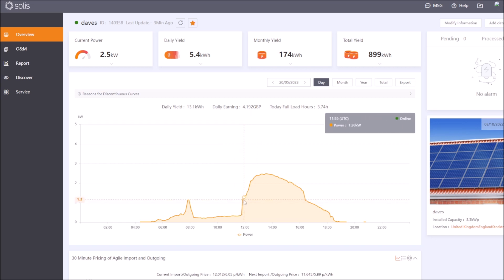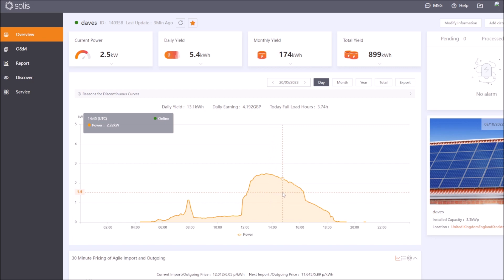That's when I see the vast majority of my generation. But since I've fully installed them I've generated nearly 900 kilowatts — and that's in less than a year. I fitted them in September and it's now May, so less than nine months. I've been averaging around 100 kilowatts a month, and that should only increase if I do dismantle them and put them up onto the roof. If you're after any of the items shown in this video — whether that's the used panels, the inverter, or the module — there'll be a couple of links in the video description below.